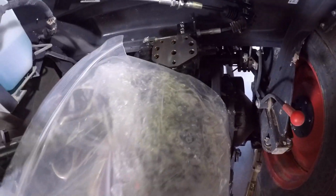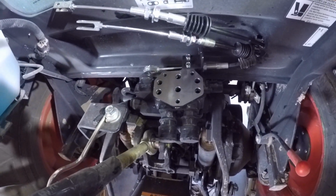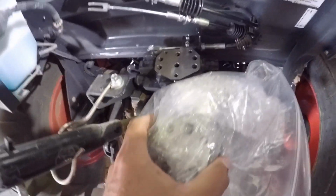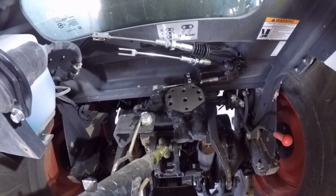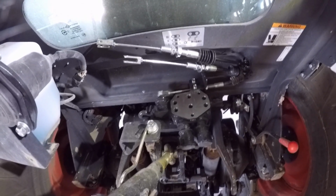Next you would put this valve body on there and then put the top cap back on. But because I'm doing a third remote, what I'll have to do is I'll put this valve body on, then I'll put another spacer, another valve body, and then that top piece. And hopefully the bolts they gave me are long enough to go all the way through all three of these. But I'll get this stuff mounted up and see what happens.